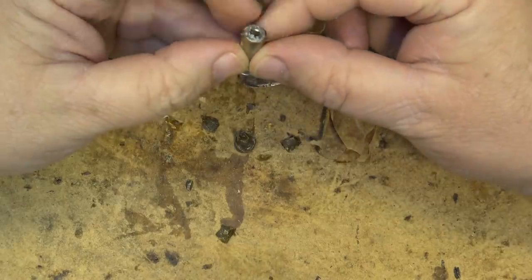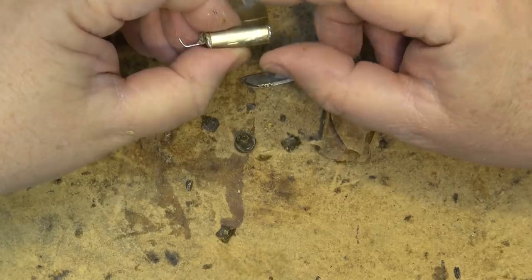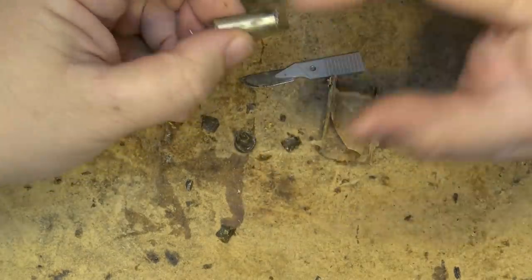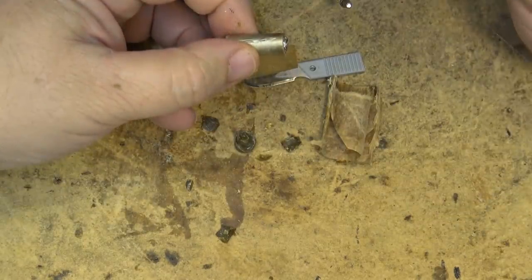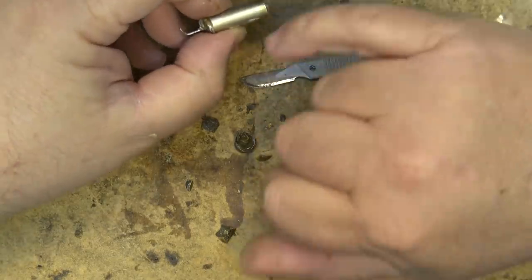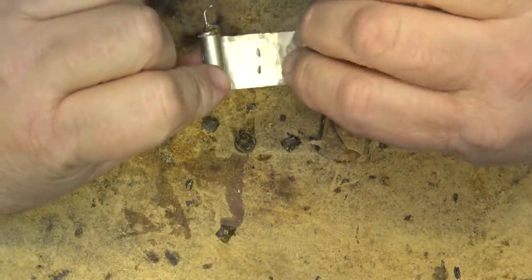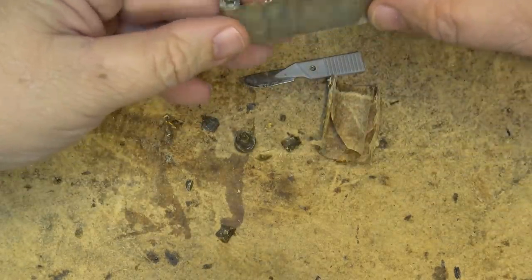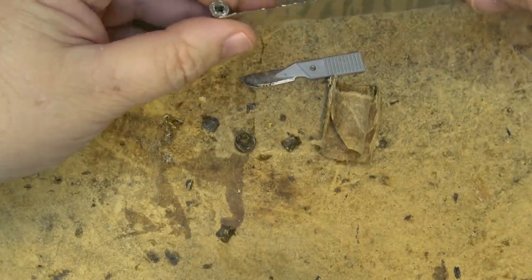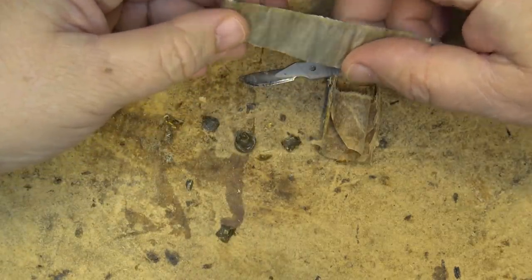But what can happen is if this outside foil is connected to the grid of your next stage, any noise that's in the air from RF interference, radio interference, or electrical interference can be picked up by this exposed foil. The inside foil is going to be shielded by the outside foil. So that is why they are marked. They're marked for no other reason. And as you can see along here, this edge is where it was connected.